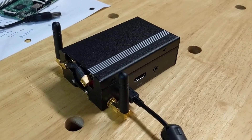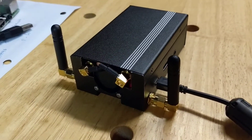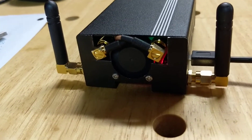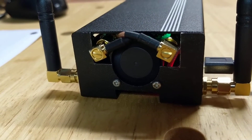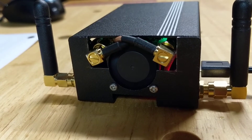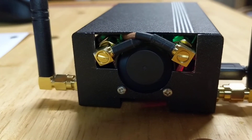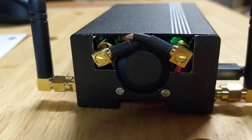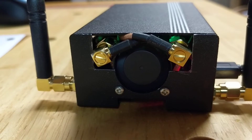It's in the El Duino aluminum case and I've got the antennas coming out the side of the case. You can see on the end of the case I had to do some modifications — there's a fan that comes with the case, and I was able to keep that fan mounted to the inside. I had to cut or notch out around the fan to allow for the SMA connectors which come out of the duplex board, and there are jumper cables there which route to the outside of the case.